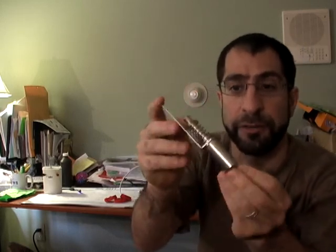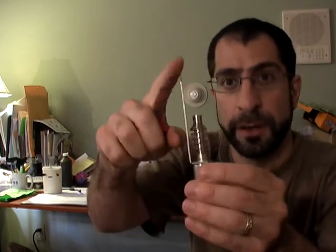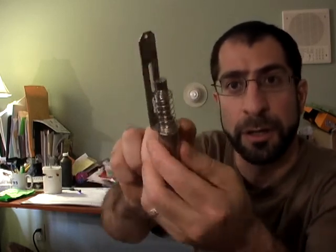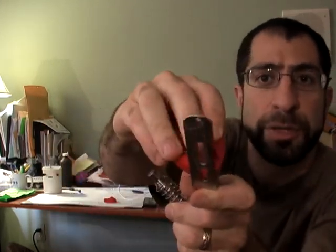So let's see if we can build a Spazzibot with these economy solenoids — we'll call it Econo-Spazzibot. First thing is we're going to have to make some mechanical changes on the solenoid itself. The plastic parts printed for Spazzy has a middle body part, and this bracket has got to go, including this edge, in order to fit through. We're also going to have to drill these holes ever so slightly larger, because it's just a tiny bit too big to fit through.